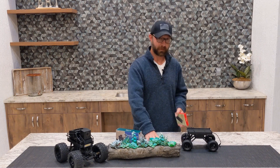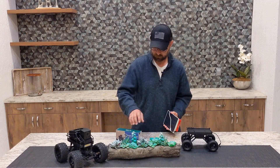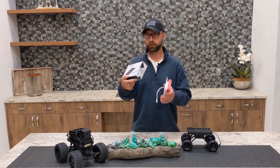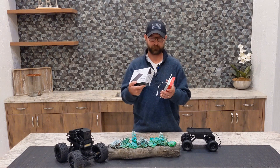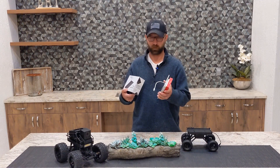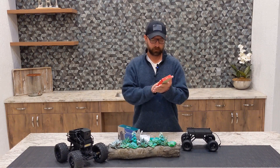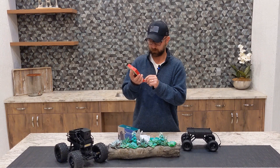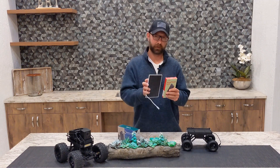So looking at the battery bank: this solar panel produces power at 5 volts, and the bank accepts power at 5 volts. The operating wattage is 2.5 watts — at 5 volts and 2.5 watts, that's half an amp, 0.5A. If you had a cell phone 10–15 years ago, the original chargers were 5 volts at 0.5 amps. The Wyze power bank accepts 5 volts at 2 amps into the micro USB input, which is 10 watts — so it works, but it's four times as slow as charging from a wall outlet.